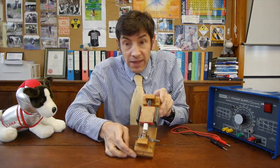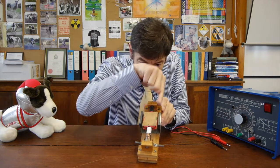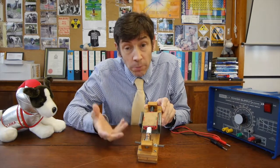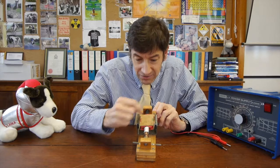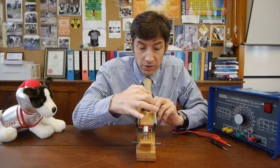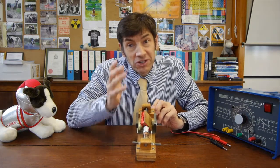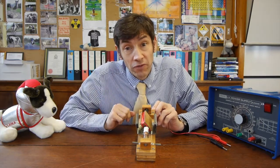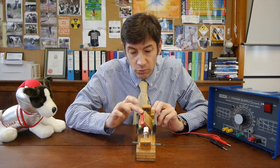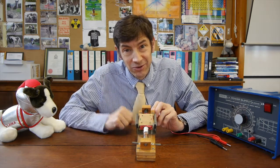The next thing you need is some wire going through the magnetic field at 90 degrees and also through the magnetic field at 90 degrees in the opposite direction. So, using Fleming's left-hand rule, one set of wires will be pushed upwards, one set will be pushed downwards, and that, on a spindle, is what's going to cause this to rotate. But there are a few things we can do to make that rotation better, and we've got to solve the problem of, if this side is pushed upwards, how can we get it to be pushed downwards when it rotates through half a turn?